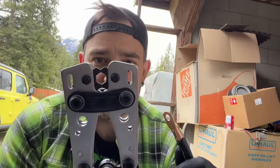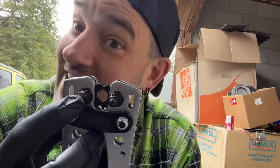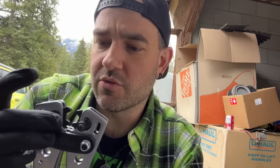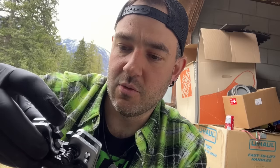Out of curiosity, I want to see how well these crimpers work. These things will crimp, I don't even know the range. They will do this, and then they will also do 2-gauge, 6-gauge, 1-gauge, 4-gauge, and 8-gauge. Well, this is 1-0 that we're doing, so I'm pretty sure that's 1-0. You can actually push these little nipples in. Or is it push? Open them up a bit. Push. Yeah, if you push the nipple in, then you can rotate this wheel inside and change the wire gauge, which is super cool. Let's bring it back to 1. You have to do it independently.